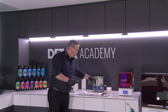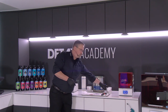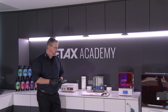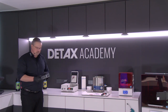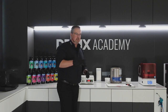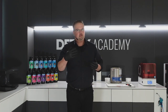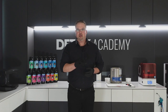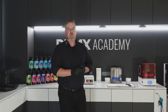After that, we blow it dry with compressed air and take it to the other box — box B. It is absolutely clean, isopropanol alcohol inside, also three minutes. That's the washing step. Blow it dry with compressed air. Then you can use the AutoFlash unit. With a clean box, take the parts inside. After that, we need two times 2000 flashes. This is 100% the same process you know from the other webinars. For the new process, this is absolutely the same workflow: take it out from the printer, wash it, cure it.